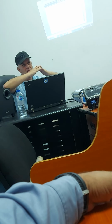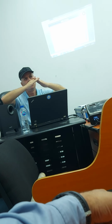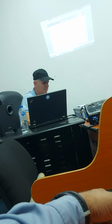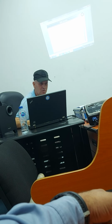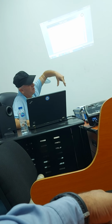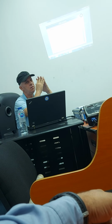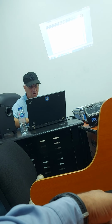If this is 5 ton, how much will it take? Angle 30, 45, 60. For example, this 5 ton sling at a 60 degree angle, how much? 5 multiplied by 1.4 is 7. For three leg or four leg, the mode factor if like this is 2.1, like this 1.5. Understand?